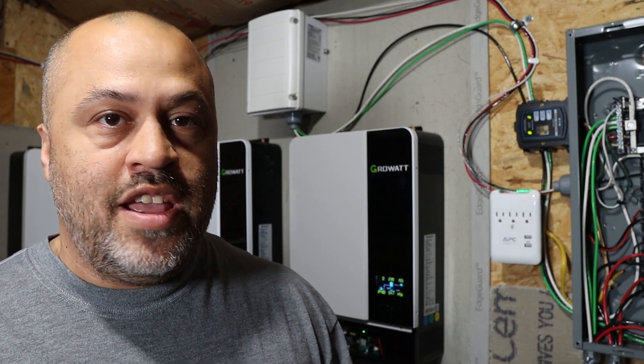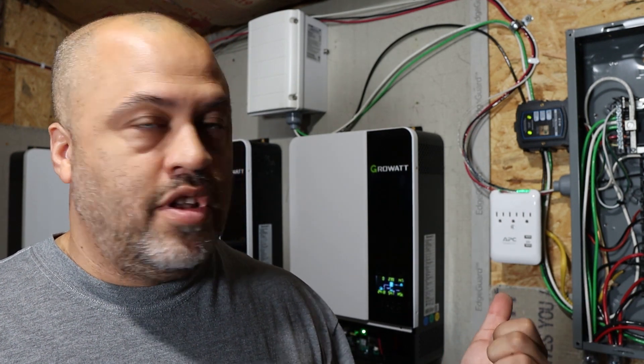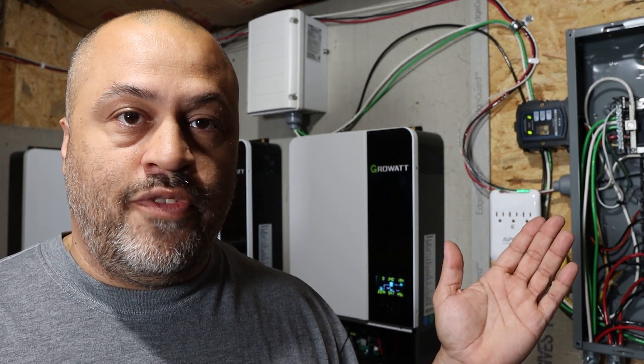This whole time, my problem was probably me — I'm not an expert, still learning and figuring stuff out. My troubleshooting method was to disconnect one thing at a time: the ground off the AC output, L1 and L2, communications cables, parallel cables, switching from parallel to single inverter — until I found when I disconnected the PV, even with the switch off, the problem went away. The only thing between my switch and the inverter on the PV line was my filter, so I bypassed it with a straight wire — problem solved. Now I just need to sort out the SOC issue.